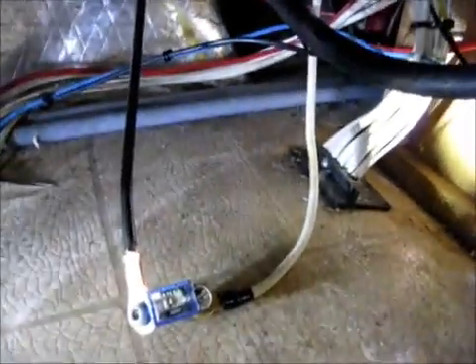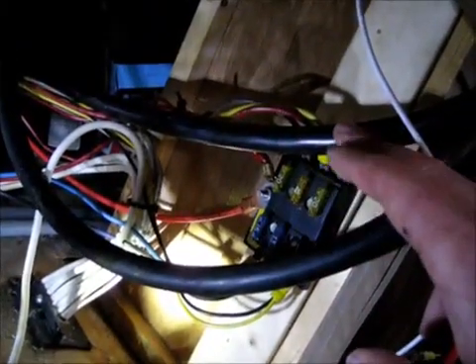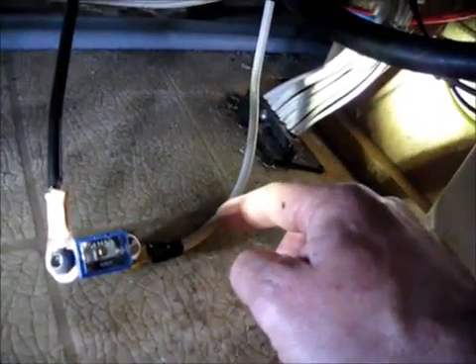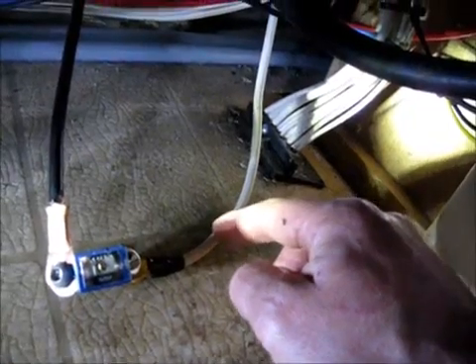That's the new wiring system. The solar panels come in through one of these fat wires and go up to the charge controller. Then from there, this goes straight down to the battery. I have the six-gauge wires coming from the battery back into the camper, which is the same size as what the camper was originally wired for — so any load the camper will have will be fine with that. When I want to use my inverter, I'm going to have to get some bigger wire though.